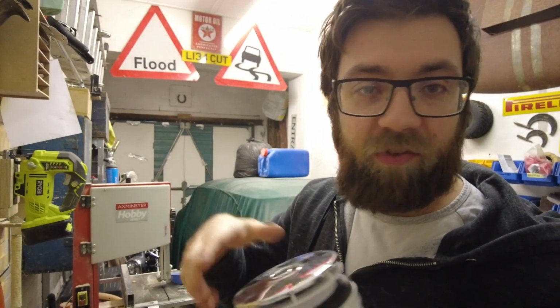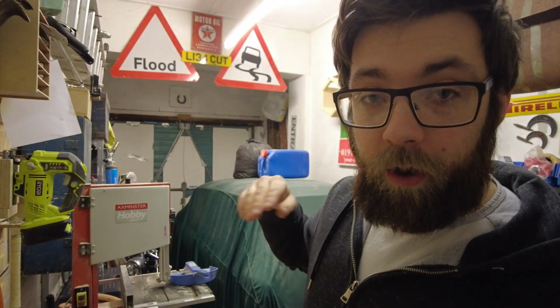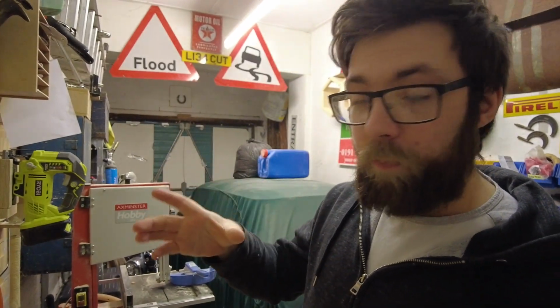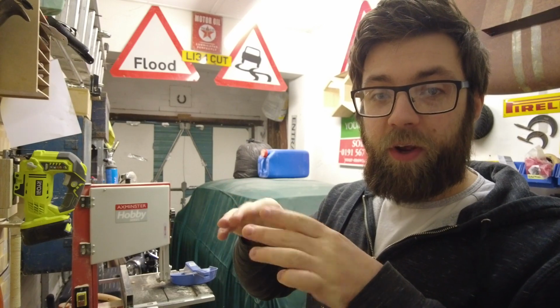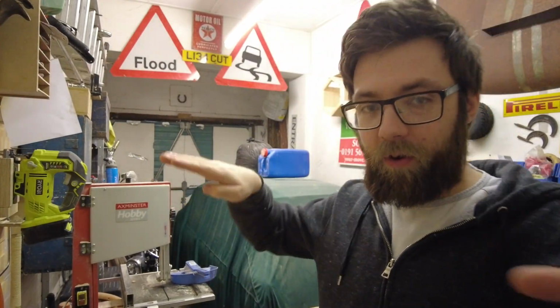This big thing is a shower drain trap, so you don't want to just go straight down into a waste tank, because it will then smell. Basically, this goes from the underside of the van. This bit will go over what I need to make, which is the shower tray thing. The way I'm going to make a shower tray is by having a bit of wood around the actual drain, and then cutting some battens and bits of plywood, and then filling it to make a nice slope all the way down towards the drain.